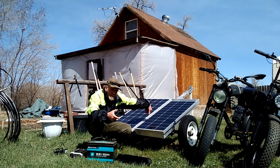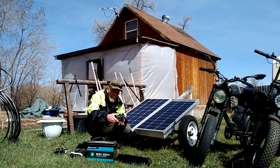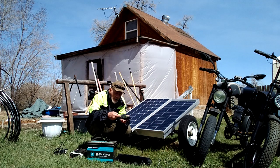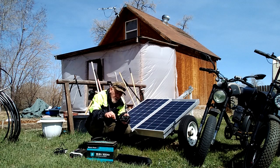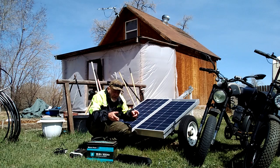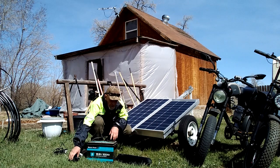All you need to do is run your wires from your solar panels together, red to red, black to black — it's going to be a 12 volt system. Then connect those to your power controller. The power controller has stubs where you just put the wires in. But before you connect the solar panels to the power controller, always connect the battery first.